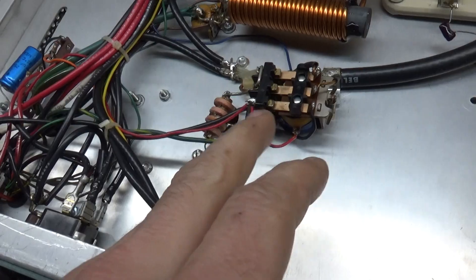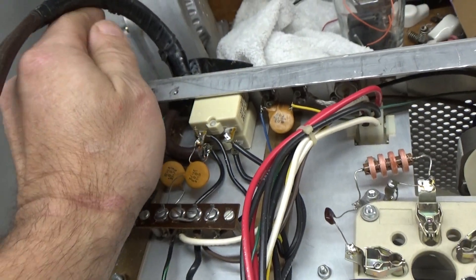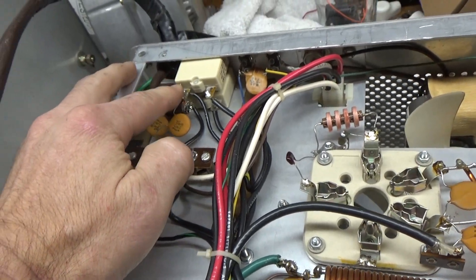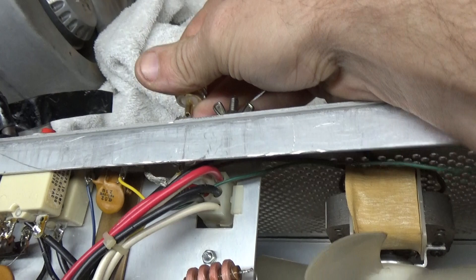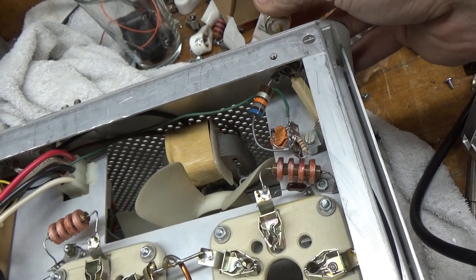It's a bias mod. Needs a lot of repair work on the wiring. The cord's all electrical taped — I'm going to have to figure out what's going on with that, and clean all this up. Does need a new SO239 on the input side; it slips right in and out. The output feels okay, I might change that also.